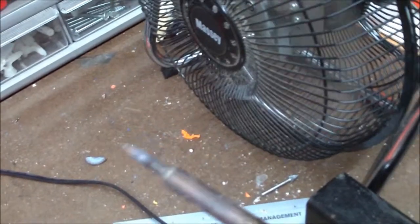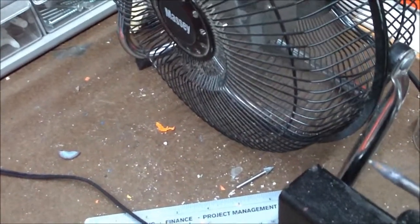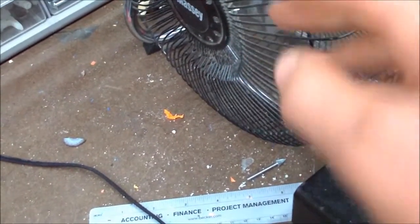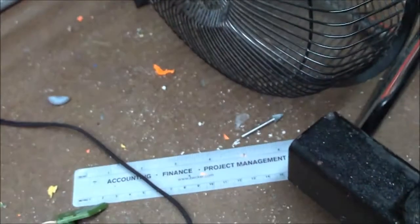Working with solder and soldering irons of the sort, be careful not to breathe in toxic fumes. Therefore you want to have a fan that either constantly keeps blowing the air away from you so it's in a well ventilated area, or you can have the fan turned around and actually suck all the toxic fumes out a window if you have that option. If not, a simple fan just blowing across your face and the outdoor will work just fine.